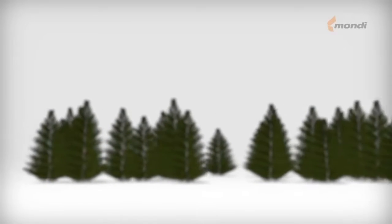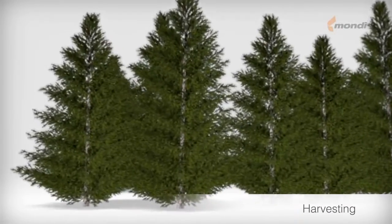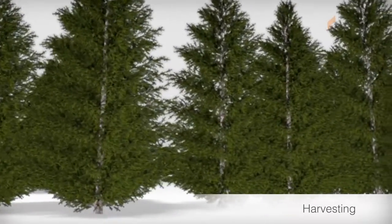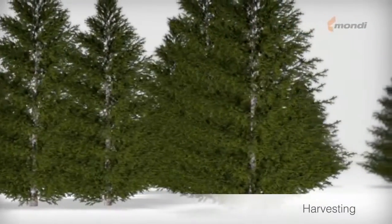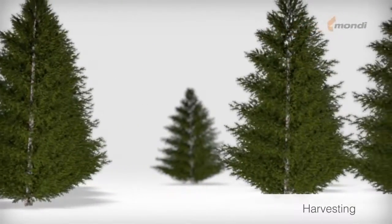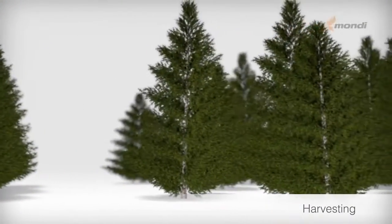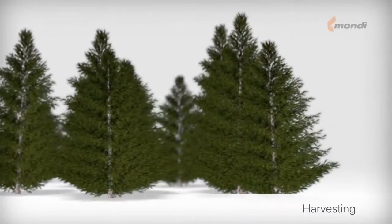The wood is sourced from essential forest thinning programs and sawmills as chips. For the production of sack kraft paper, we use long fiber wood, which ensures highest paper strength. For the production of speciality kraft paper, a mixture of short fiber and long fiber wood is used to ensure both high paper strength combined with excellent surface and optical properties.